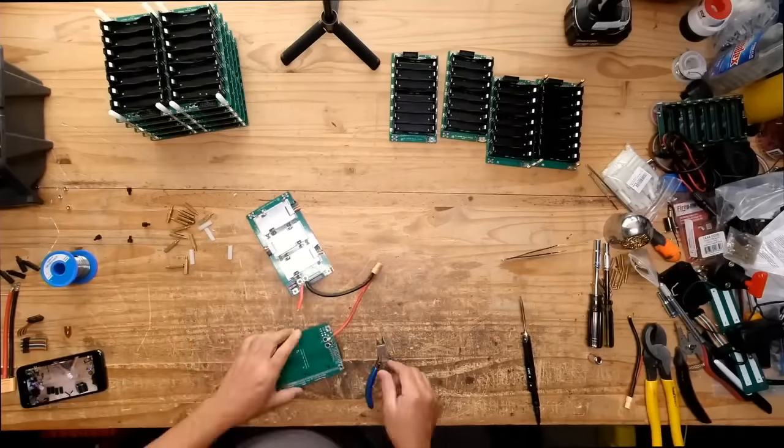And a lot of those are being decommissioned now because they really didn't know how they were gonna make money. It was kind of a scam. They wanted to try this out, but they didn't figure out how to make money on those. So I think now those battery packs are hitting the recycling centers by the thousands. It's crazy. A lot of the times those batteries didn't get much use because those scooters got beat up and abused so much that they were wrecked. I bet some of those have maybe 100 cycles or something. When you take them apart and test the cells, they still give us 90, 95% of the original capacity. So they're very good cells, and at 60 cents a cell, you can't beat them right now.